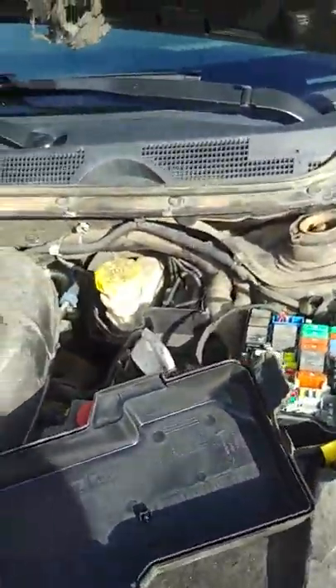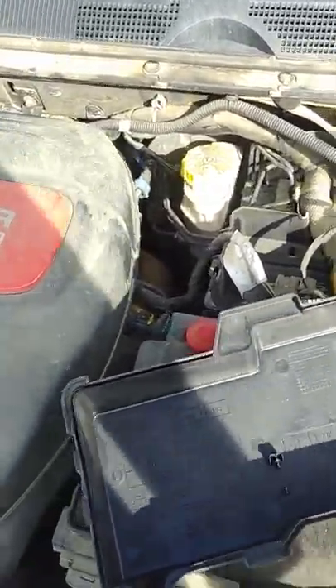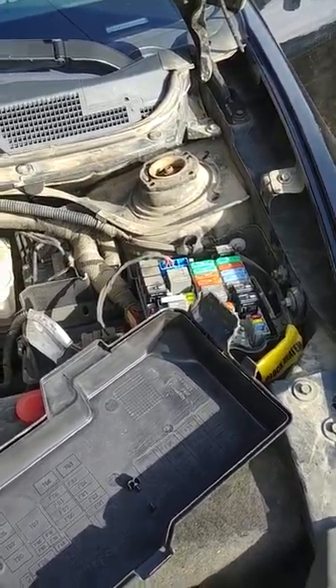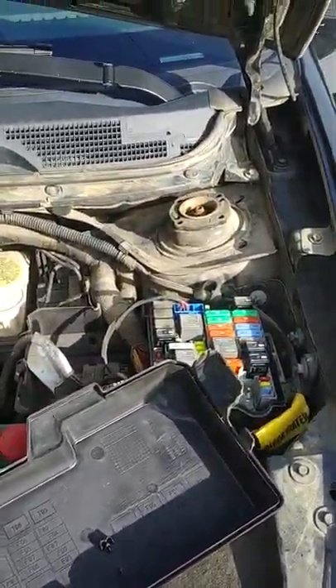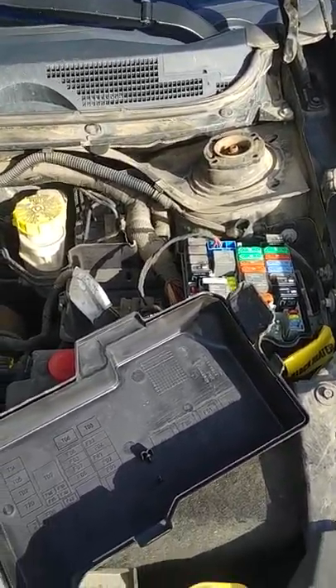Anyway, that'll help you out. First, check your fuses. Then check to see if the fan spins freely. Check the power cable going to the blower motor. And if all that's working, try replacing your blower motor altogether. I hope this helped some of you — it certainly saved me probably a few hundred dollars just to have somebody spin a fan by hand. Have a good day, YouTube. Bye.